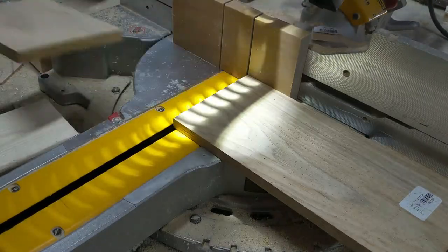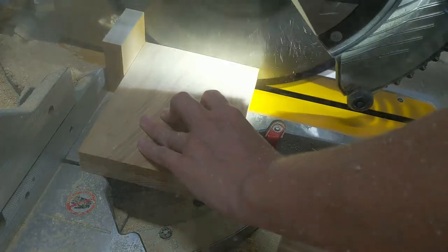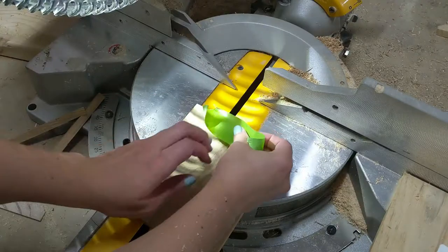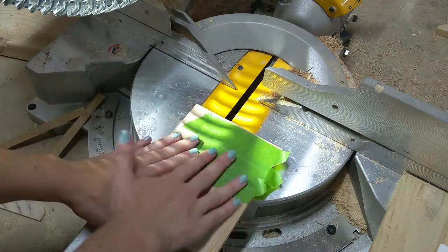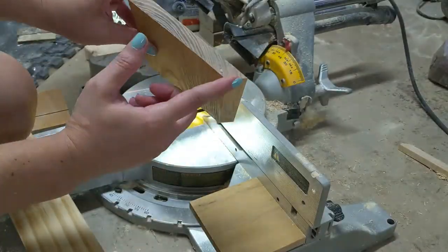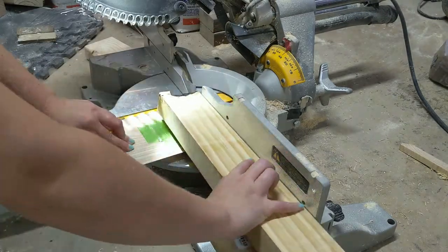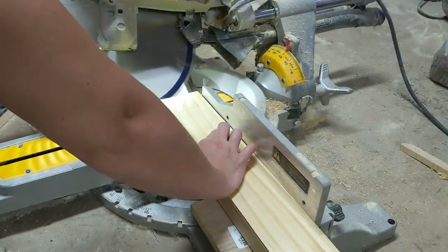I started with a thin piece of white ash and cut three sides all of the same length. I wanted to use a bevel on the front two corners but the pieces were really narrow and I didn't feel safe getting my fingers so close to the blade on those angled cuts. I tried extending my hand placement using another block of wood but still had a little movement, so I added tape — first painter's tape to avoid residue, then super sticky carpet tape to create a strong bond between the piece I was cutting and the scrap piece holding everything in place. I found I could peel and reuse the tape layers carefully for each cut.